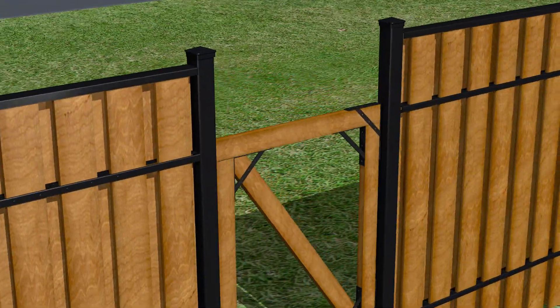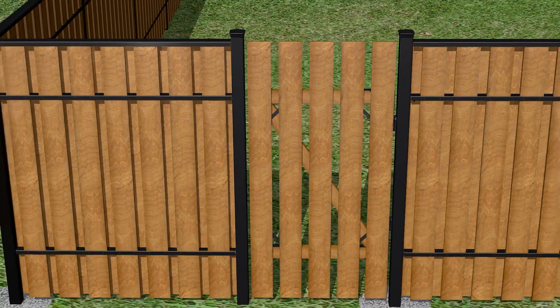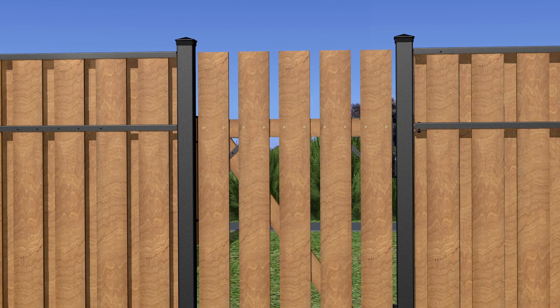While the frame is hanging on the post, you can start cladding the outside frame with fence boards, starting with the two outside boards being flush with the frame, making sure the boards are level with the top of the fence sections on either side of the gate posts. When screwing boards in, ensure that the screws are level with the stringers on the flanking fence sections, so the rubber strap will hide them later.